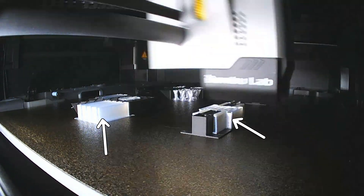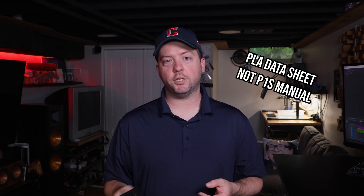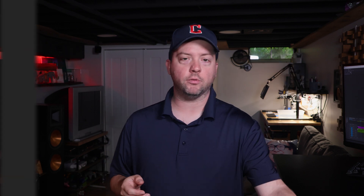So let's talk about these results, but first — what is a support and why do we need these things anyway? Well, a support is a thin structure added to the model to support overhangs. This could be an aggressive wall angle or a bridge. As a printer tries to stretch the filament over these gaps, it can only go so far before you need to prop it up with a support. These support the filament meant for your model, which would otherwise fall due to gravity.